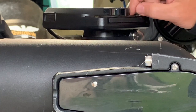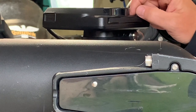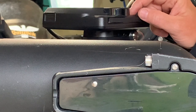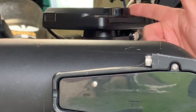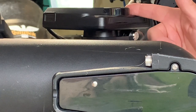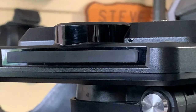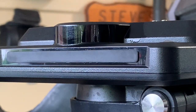I'll click it one, two — and now it is in 60 degree mode. When this motor is in the water, this side is going to be facing up towards the surface, and therefore it could catch some of that reflection causing the annoying arc. So I'm going to put the Megalive mask right over here on this side. I'm just going to clean it with a little rubbing alcohol — that's the side facing up — and I'll let that dry and evaporate quickly to give me a nice clean surface to put the mask on.